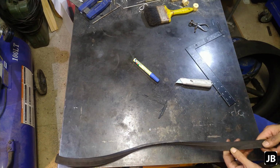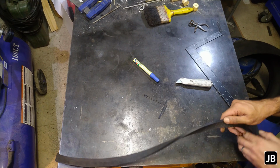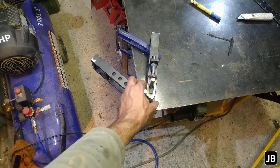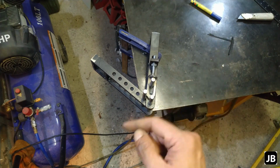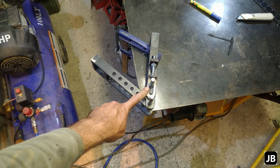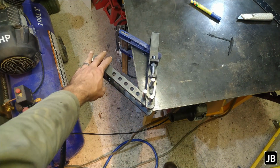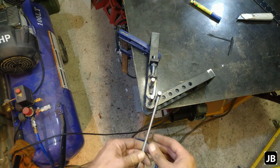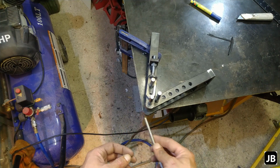Okay, so now that we've got that done, we need to bend some hooks for it. So let's get the bender out. Okay, so this is my homemade Horsfall style bender. If you haven't seen the video, I'll put up a link in the description. So now we need to bend some eyelets for our little bungee cords. Now I've just clamped the bender to the table. I must still make a little mount for it. So let's see what we can get to. What I've got here is a piece of 6mm 304 stainless. So we're going to cold bend that and see how it goes.